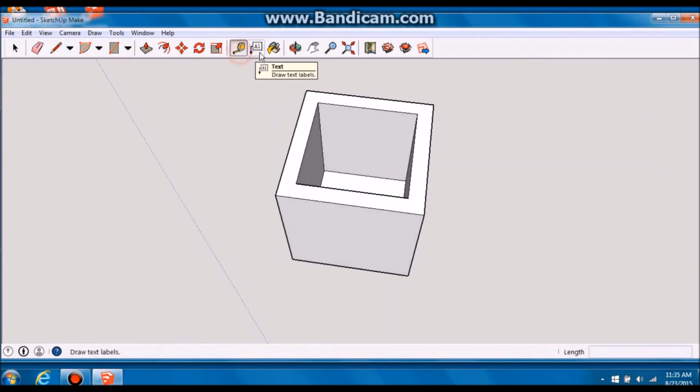So to make sure that my measurements are right and that I didn't mess up anything, I always measure all of my dimensions. So that's 1.950 by 0.950. Okay, so yep, that's good. And now I'm going to measure the wall thickness, which, like we typed in, the offset was 0.2250. So that's right. And we want it to be 2 inches tall. And that's right.